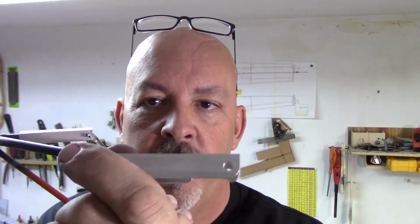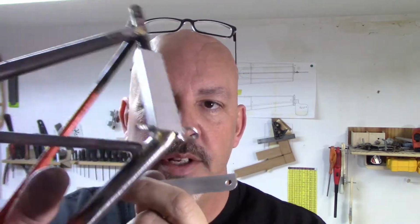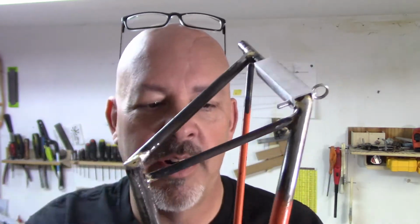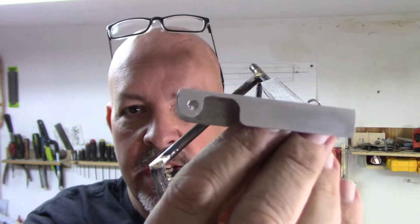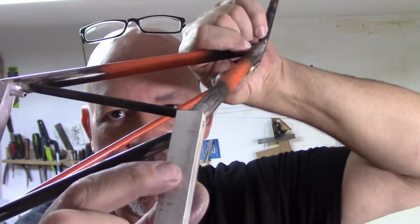Here's the rear hinge. Now the front one was that goofy one I was telling you about. You start off exactly the same as the rear. Just set it up in the drill press and drill the hole through it around the edges. What you have to do to make room for this diagonal going across right here is cut a channel in it. So this is going to pop down over the top like this, and then you put the pin through it. I've got to run up to the hardware store to get some bolts. That's why I've got a pin and a bolt.